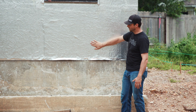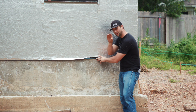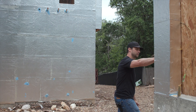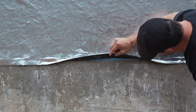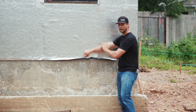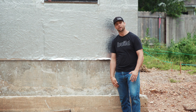The wall coming down to the foundation is another very weak spot for air infiltration. On the inside, that fire-rated spray foam between the bottom plate and the foundation chips away, and if it chips away, air can leak right through that seam. What we do is use Blue Barrier joint filler — it's an adhesive as well as a filler, so it fills the gap and sticks tenaciously to both the concrete and the bottom plate, preventing air from coming through. We did that before putting on the Polywall Alumiflash, and then we Alumiflash it down underneath that seam so any water that gets back there runs and drains away on the foundation.